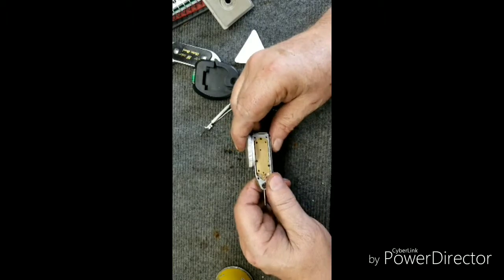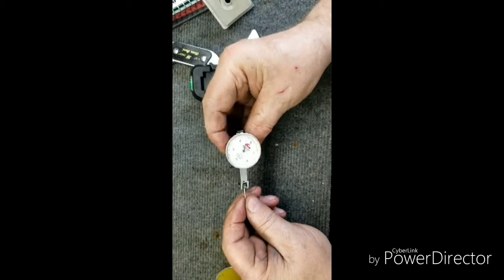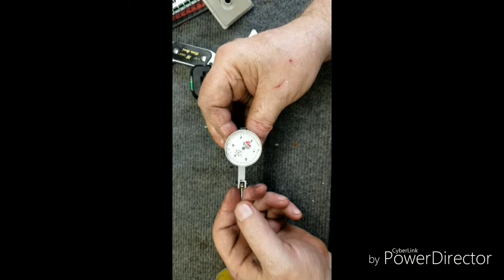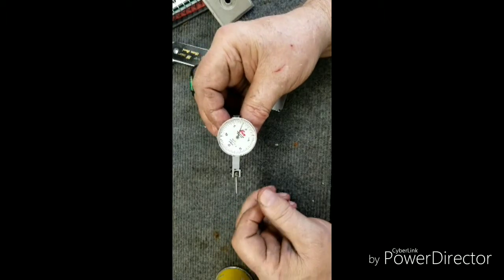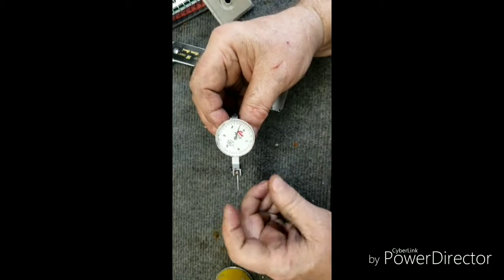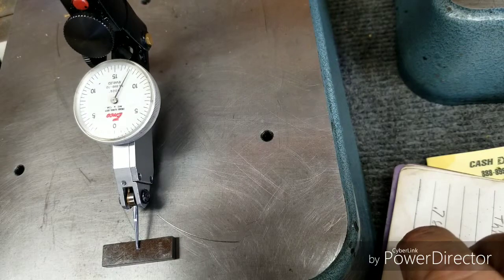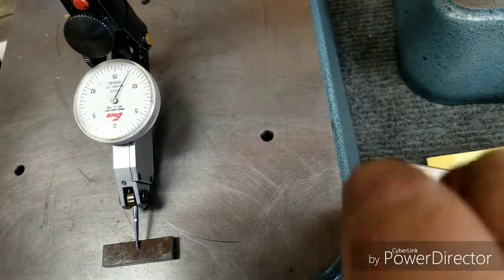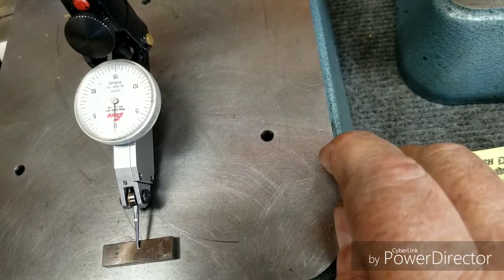Okay, we got the screws back in it. I had to go get a little magnet to put on the side of my screwdriver — I couldn't get those little screws to line up. It seems to be working fine now. That spring had jumped on the wrong side, and I just added a little bit more tension to it. We'll come back and put this back together and check it with gauge blocks. Okay, we've got her back together now — we're going to check if the indicator is accurate.